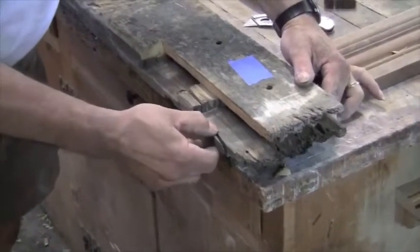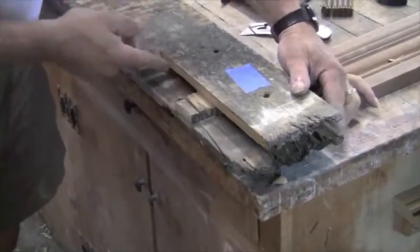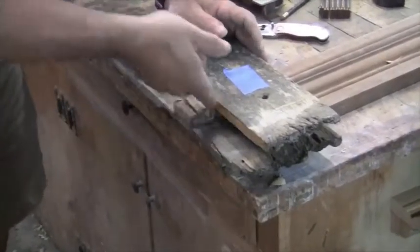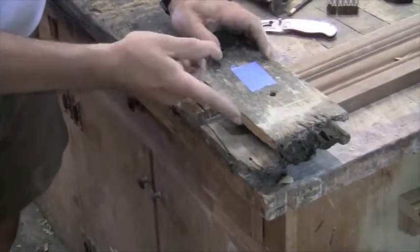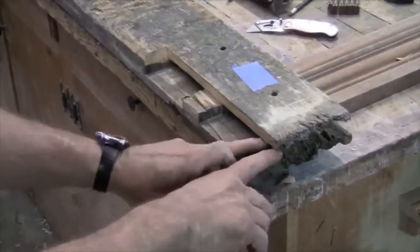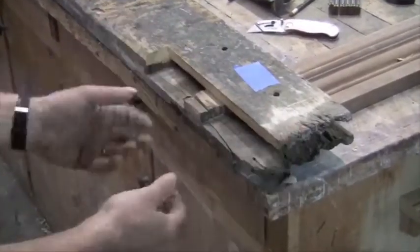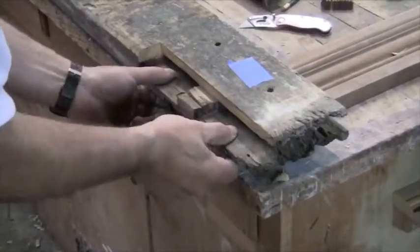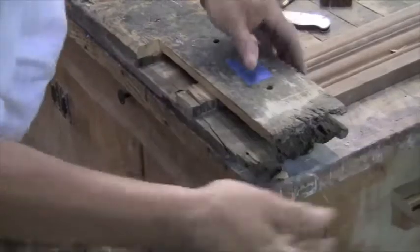Loose, but I can pour some glue into that and re-adhere that. Now I've got this piece that was rotted and busted off the edge, and it's a nice clean line, and truth is it's, as they say, good wood. It's been unexposed. So now it's a matter of making a new shoulder to fit in down here, making a new plate to go on the top, putting a couple of shims inside here so that when I clamp it together I don't collapse this thing and make the mortise too small, and goobering it up and putting it together.